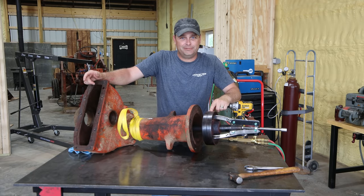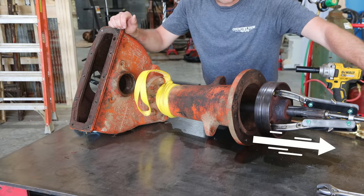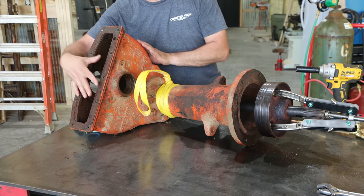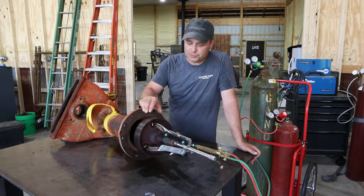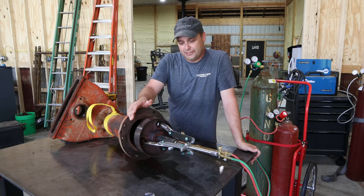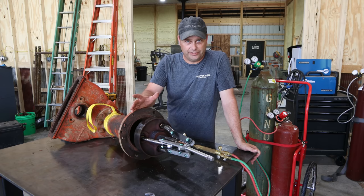I've been having a hard time getting this final drive assembly completely taken apart. I have to take the brake drum off of the axle so I can pull it out, because the axle pulls out this direction — there's a gear on this end and it only pulls out the far side. This brake drum is press fit onto the axle, so it's a pretty tight fit, and it's probably been on here for years. First thing I tried was just a normal three-jaw puller to see if it'd come off — of course it wouldn't. So I decided I was going to have to heat this up to try to break it free.